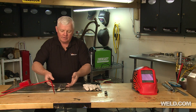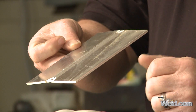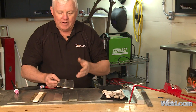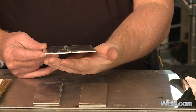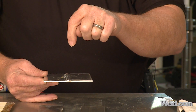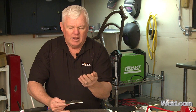I've got a sample already pre-set up and pre-tacked. This is 6061 aluminum, and I'm going to be welding it with 4043 filler material. Now, if I try to weld this freehand and penetrate through — a couple of secrets. One is you don't have to put argon backing on the back side, because when you penetrate through, you're going to have all the aluminum punched through, and then it's going to oxidize naturally and actually create a little membrane for you. It'll work in your favor.